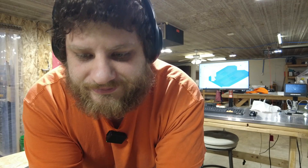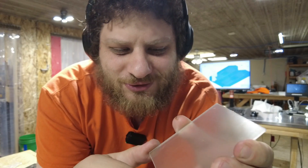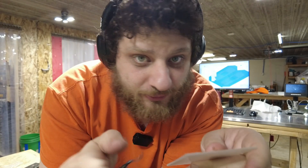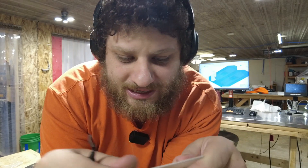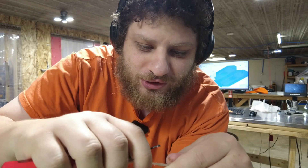That was not a sharp blade — let's try again with a sharp one. One of these tools does a really nice job on acrylic. And one of the repeat themes here is that sharp tools make a big difference; that also goes for the end mills you'll use to mill your part. A brand-new tool will cut a lot better than an old worn-out one.